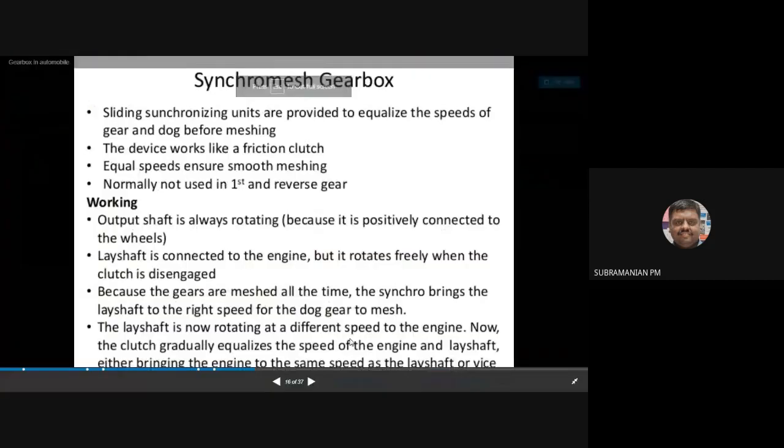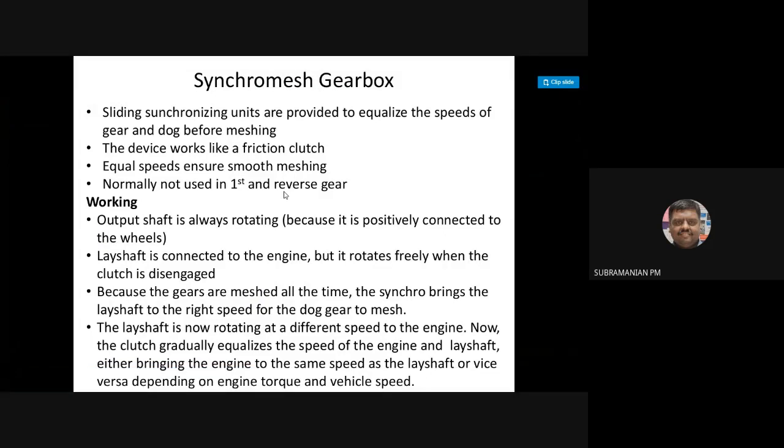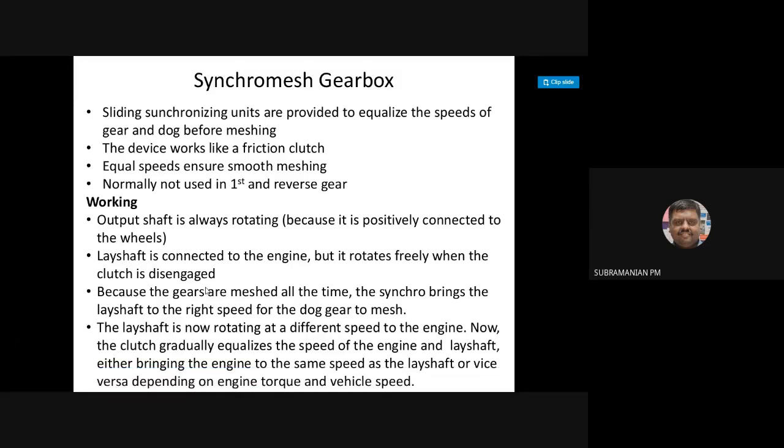See, synchronizer is normally not used in first and reverse gear. That is a practical point of view. That is, where to use a synchronizer is in higher gears only. Okay, so this one also you please make a note: the output shaft is always rotating. It is connected to the wheel, so it will always be rotating. So for power transmission in higher gears, the synchronizer will be coming in. Okay,